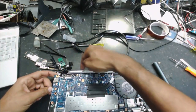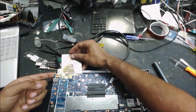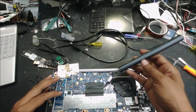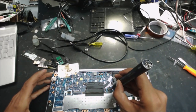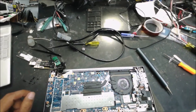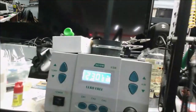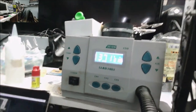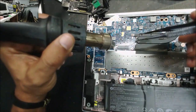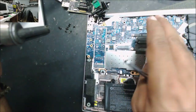We lift the board a little bit so we don't get a lot of heat under the keyboard. And that's the chip we are going to remove — the one right here. It's about 450 degrees. This board with the heat deforms quickly.